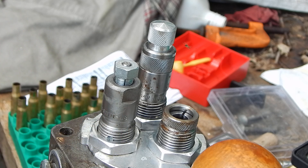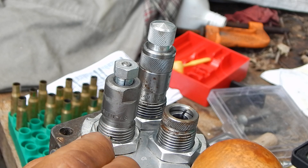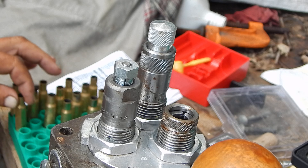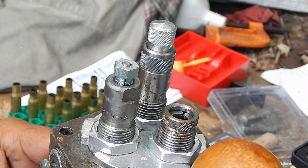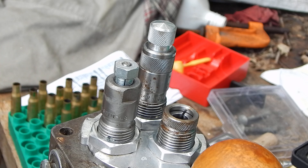That's exactly what I was talking about — that vent hole here that lets the air out. Because otherwise, you know, you can't compress air indefinitely. It comes to a limit. And a full-size die is a tight fit in there. You've got the expander that's pushing the neck out, so it just seals it, and then you start compressing that air. If it's got nowhere to go, it's going to start popping dimples in that shoulder.